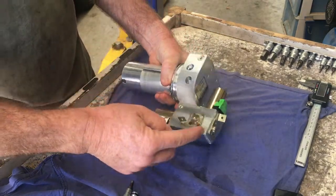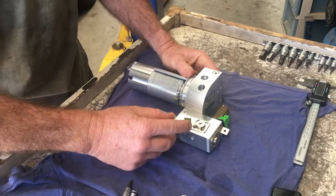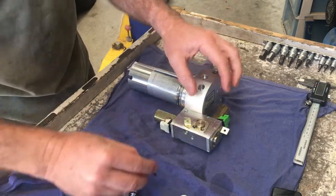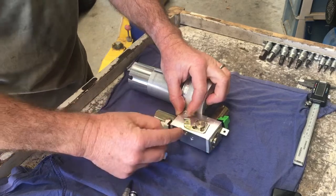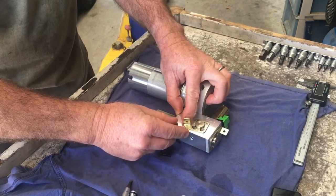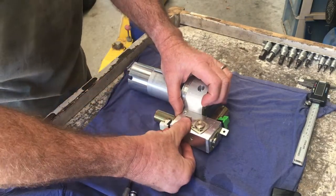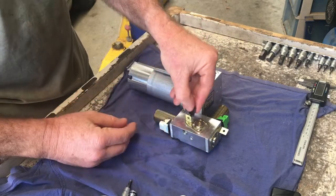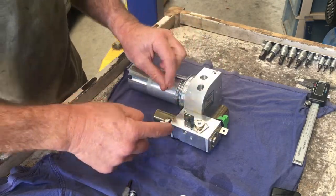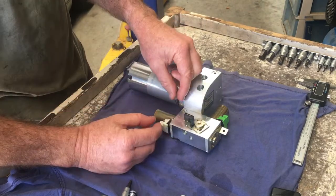For the hydraulic connections, both the top and the side one here look exactly the same. The hydraulic lines are held in just by this little clip. When it's in release mode like that, you can actually just plunk them straight in there. There are O-rings on the inside that seal everything. Then you do that and it actually just locks everything in place. With it locked in place, that little clip goes on it, which holds against one of the hydraulic lines to make sure it can't actually come loose.